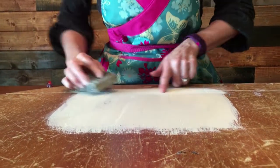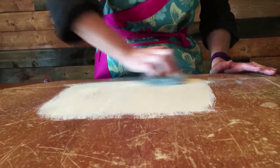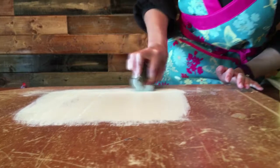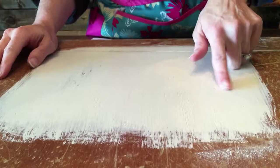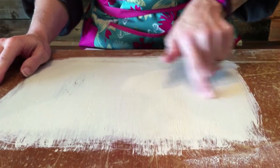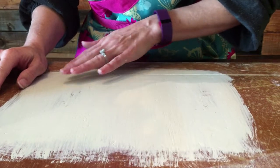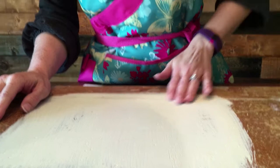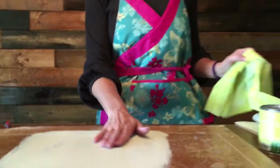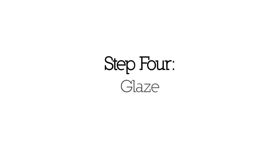There's a little bit of distress from the big table being old that I want to show — the grain in the wood. That's the nice thing about milk paint: it sands so nicely. You'll see a little bit of the wood here, some distressing where bumps show through. I like that old look. Here along the seam I did some distressing. Once I'm done and have it distressed to where I want, I make sure to clean off any of that dust.